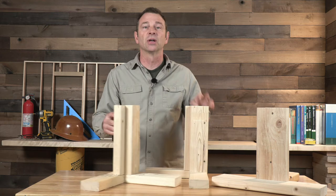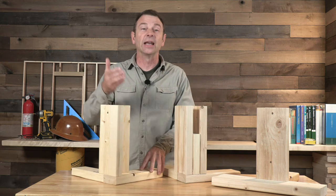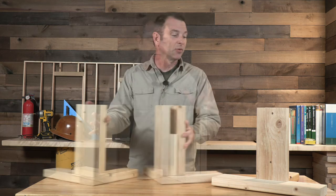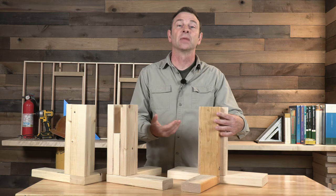Then you'd move on to your California or energy-efficient corner and show how you have an advantage in this one that you don't have in this one. We even have a T-connection here — this is a version of how to make a T-wall connection with a 2x6 nailer. We can start with textbooks, but we need something that gets us to this.